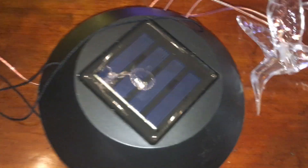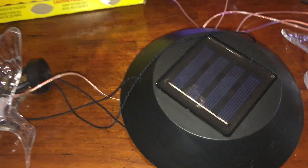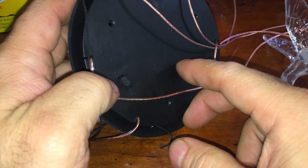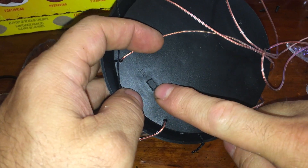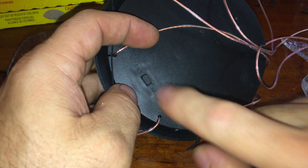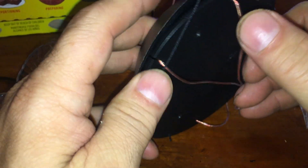So you want to make your solar lights last — what kills solar lights is water, which causes corrosion. With this one I'm taking the screws off to inspect it. The absolute worst thing they can do with solar lights is put a switch on there. These are your main fail point because they corrode no matter what, the switch stops working, and your lights aren't on anymore. There should be no switches.